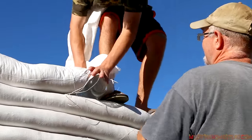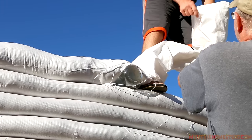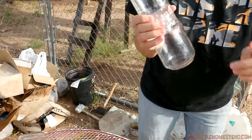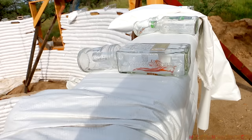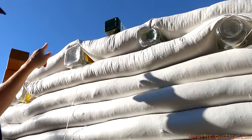From our previous buildings, we've learned that with bottles you can't just run barb over them and tamp over them like normal, because all the weight when it starts building up will eventually break that bottle. You have to put the bottle in, bag up to it, then do a thin layer over the top and keep going. When you tamp, only tamp up to it and don't tamp on top until at least you get the next layer on. Don't lay any barbed wire over or underneath them — just up to it. What works really well is to put two bottles together and tape them off. Beer bottles form a kind of little arch.